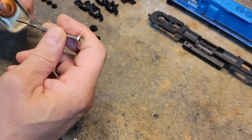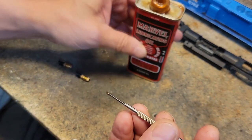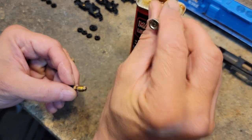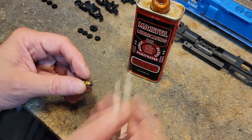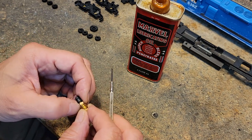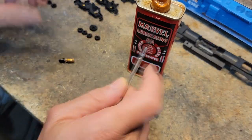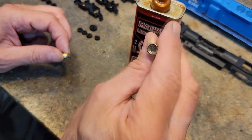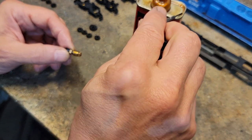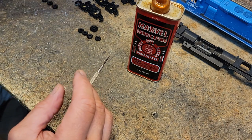What we want to do on the worm is take some air tool oil and put it next to the bronze bearings on both ends — just a little bit of air tool oil on there. Air tool oil is a good long-term protecting oil that doesn't wear out. Unlike mineral oil, you've got to be careful about using three-in-one because that's mineral oil and it will wear out after a while under constant use. You don't want to use mineral oil or a detergent oil because it will spread everywhere. Air tool oil is the perfect stuff for that.